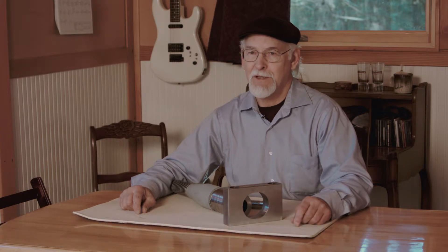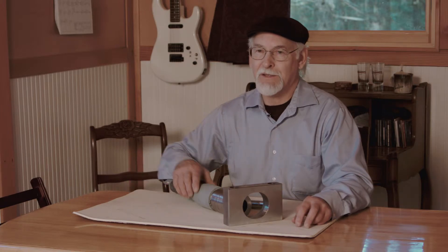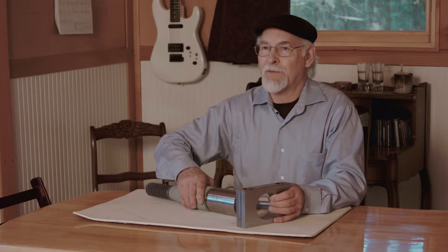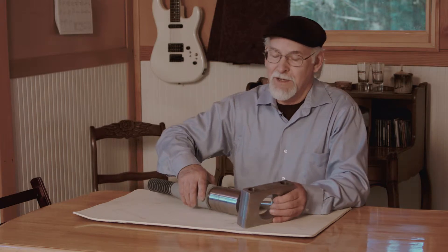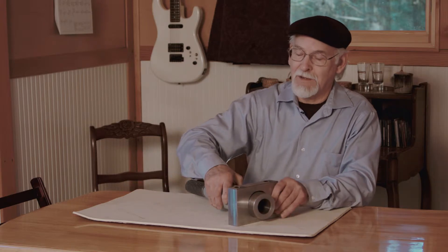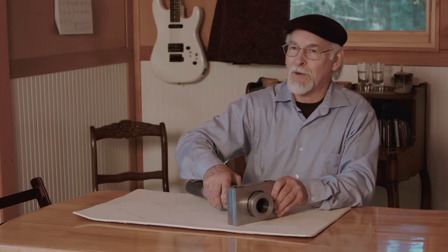We're going to examine how we can support additional loads into the framework of the foundation of a treehouse. Let's assume that we've correctly got the pins into the tree — the fasteners — and now, especially if we're remounting an existing treehouse, we use an interfacing device that allows the tree to move torsionally.